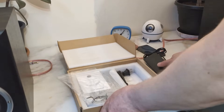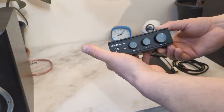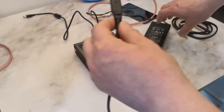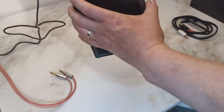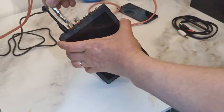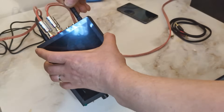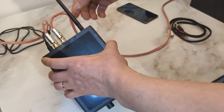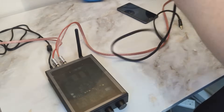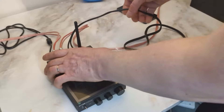Prepare your power supply — if you have a 48 volt I suggest you use a 48 volt. The amplifier itself has a small, compact design and is quite powerful. Make sure you are connecting all the cables necessary: put the barrel jack for the power supply, connect all the speaker connectors from the left channel and the right channel, and install the antenna because it has built-in Bluetooth. That's really nice because it allows you to connect your mobile or whatever streaming device you have via Bluetooth, or via RCA cable, or via a jack output device.